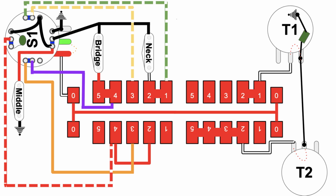Okay, so the way the super switch works is you have 5 positions, and it actually has all these different nodes in there. It's got an extra set of nodes for each of the positions, and you can see here we're in position 1. I'll just go back to where I have nothing selected. You can't actually select nothing. You have to pick one of the 5 positions. And you see there's no connection between any of these nodes and the backbone going through the middle.